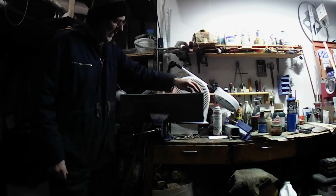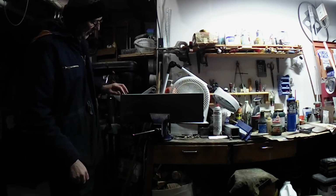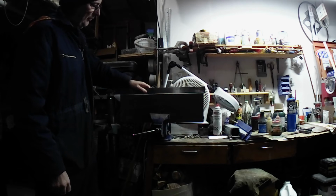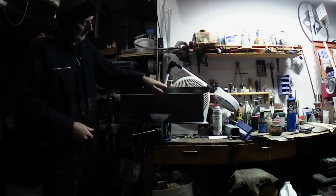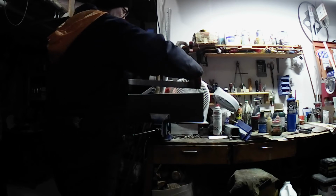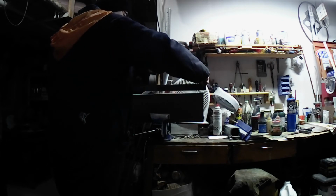So what happens is you get a subtle bow this way. This is bent slightly more at the edge, and so is this, compared to what's in the center. You set this on here, and at first you can't see anything, but you'll note that it rocks. You hear that? There's a high point in the center which causes this bar to rock.